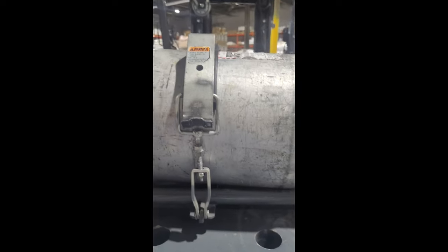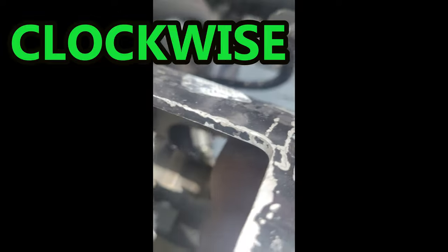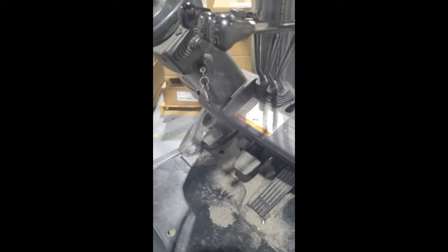To get the cylinder off, there is a procedure. Before you remove the cylinder — usually when you are removing it, it is already empty — to ensure that there is as little escape of gas as possible, the first thing you need to do is turn this knob and ensure that it is completely off. Then the next thing you would do is go to the forklift, turn it on, and allow all the gas that is in the line to burn out.